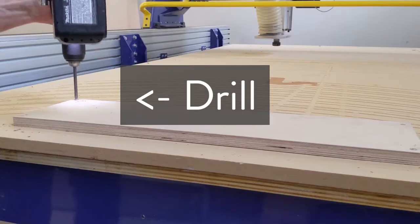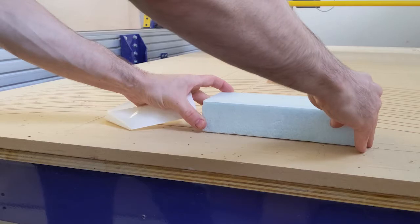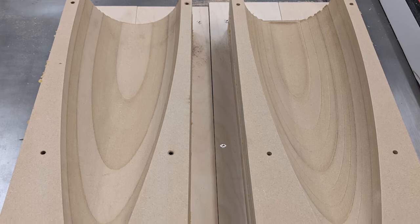Consider how you plan to hold your parts down. For work holding, we use screws, brackets, and sometimes double-sided tape in cases where our cuts are very light or low to the spoil board. For example, one team glued their part down to a wider piece of plywood, making it very easy to screw into the ShopBot bed. Make sure you avoid trying to machine a part from stock that is too close to the size of the part to be adequately secured.